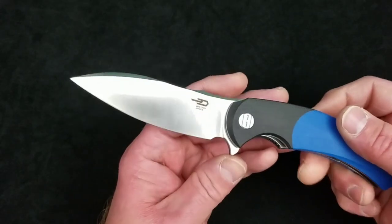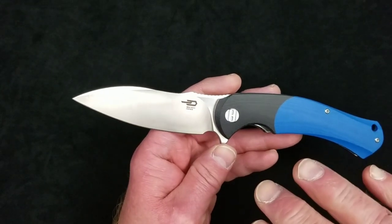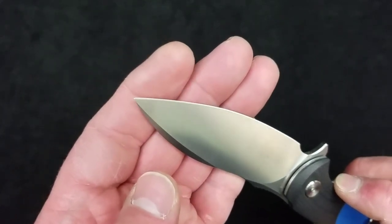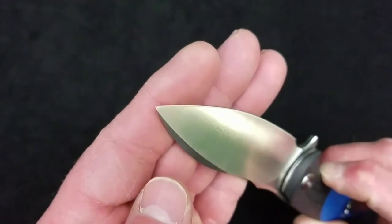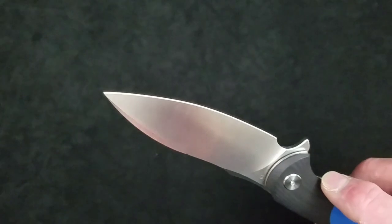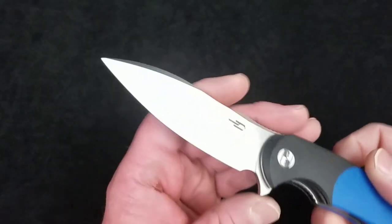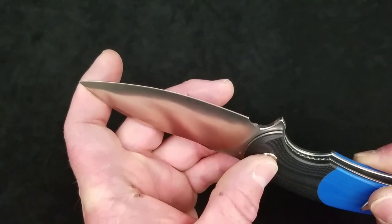Sorry about that focus issue. That is from the light reflecting off of that satin blade. No issues in the grind at all, except for one niggly little thing, and I don't know if you can see, when the secondary bevel, the edge bevel, was done, the tip on the back side was barely rolled. Now, when I finally resharpen this knife, that will come completely out. It still has a good tip that catches instantly. That is just one of those little itty-bitty things that a reviewer should pick up on. Other than that, the edge is ground very even, very well on both sides.